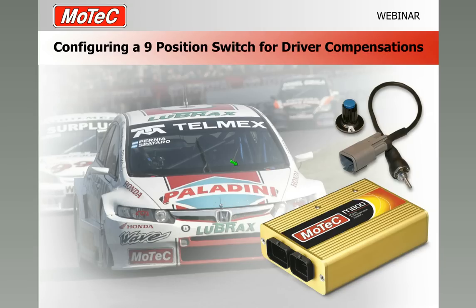This is a picture of the one you can buy from MoTeC. It's effectively a switch that has nine — in fact ten — different positions, and at each position there is a different resistance. We feed a voltage into one of the pins and a different voltage comes out of the signal pin depending on which number you position the switch at.